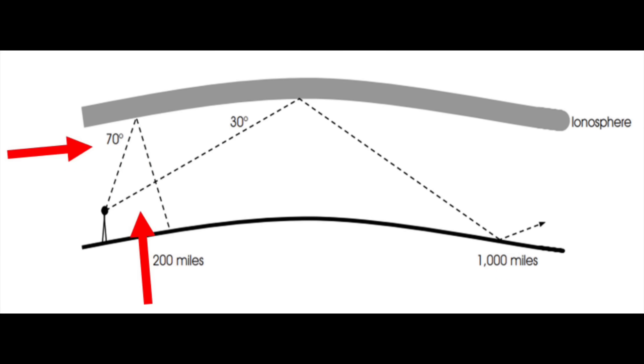Well, the textbooks tell us, of course, that horizontally polarised antennas do better at 40 metres portable during the day. Theory tells us that for an antenna to work well during the day on 40 metres, it needs to send RF up at a pretty sharp angle. So we're looking at NVIS-friendly antennas, with angles of around 70 to 80 degrees takeoff cited as the ones to chase.